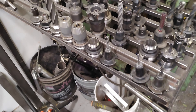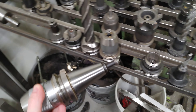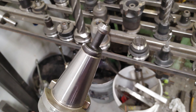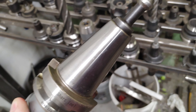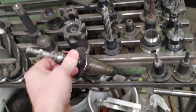My tools for it — it's kind of awkward because both machines have got different holders. The mill I use all the time is ISO 40 and then the other machine is BT 40. But they're actually the same taper; it's just the ends that are different. So you can buy an adapter that fits onto this one so I can use these tools in my main mill — I just can't use the ISO 40 tools in the BT 40.